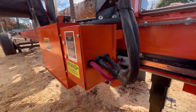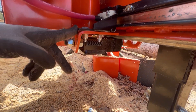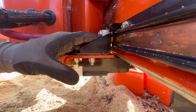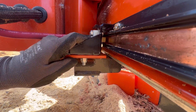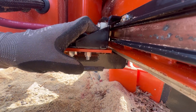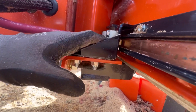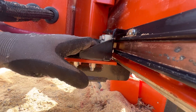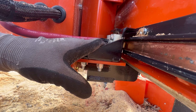I've got everything buttoned back up and the contact back on here, but it's still loose. What I'm going to do is bottom this thing out on these springs, then back it off, and then give it about a sixteenth of an inch — just a little push in — so it's making really good contact but I've still got plenty of play in the spring. As these things start to wear, I can give it a little extra later on. I'm going to tighten that up right there and then we'll see what she does.